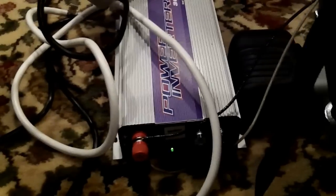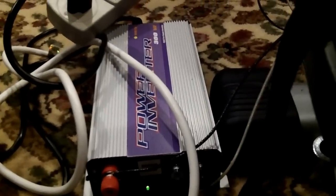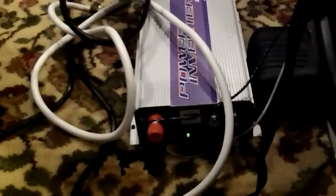And exercising against electricity is a wonderful feeling in terms of resistance. But that was the game changer for me, because when I used the traditional grid tie, which again is shown over here, that doesn't have that dump load, it didn't work. It would power out. So I would be able to get possibly some electricity on the first go around, but then I lost any type of extra power because everything had to reset itself and go from there. Now you can, if you want to, connect something to the dump load here, which are these two, but it's not necessarily required.